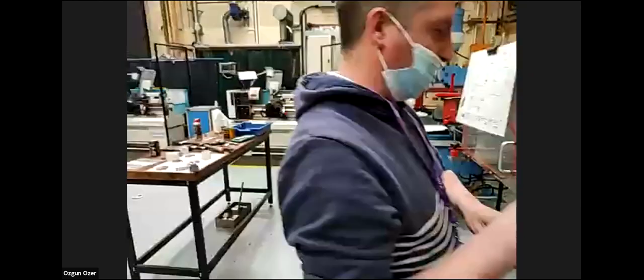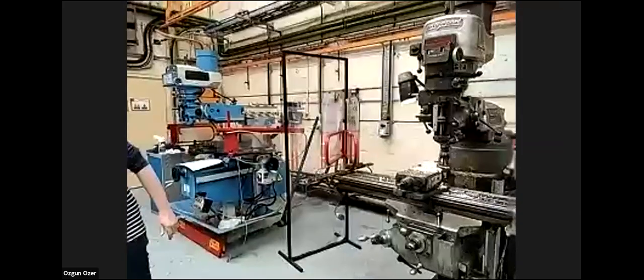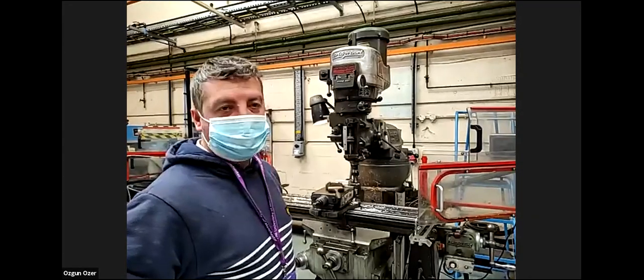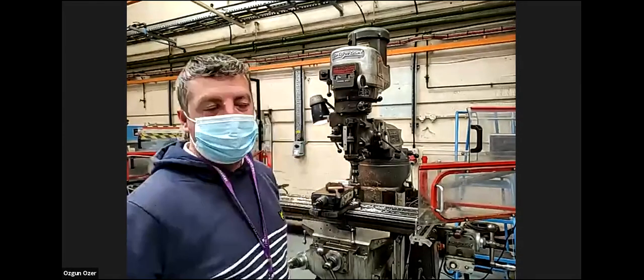That's finished the shoulder milling operation on both sides of the component. So, Alan, I just want to have a discussion. For safety, we have to make sure of the safe spindle speed before cutting. Yes. We get the spindle speeds from the catalog of the end mill manufacturer.